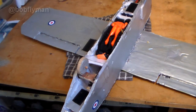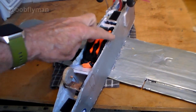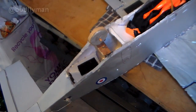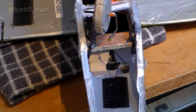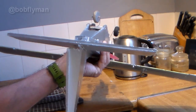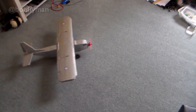With the rudder in the central position and the wheel in the central position - if I was doing it again I'd know where to start, but it was all experimental. All in all, pretty pleased with it as an engineering idea. I'm going to glue it in now, put it on the ground and see whether it'll taxi. And there it is - working nicely, working in unison with the rudder, and it will steer nicely, which is what the whole project was about.